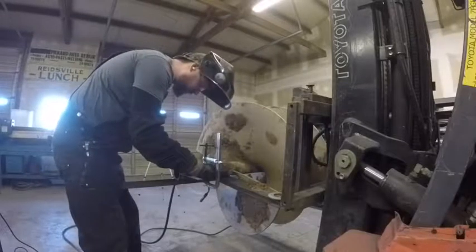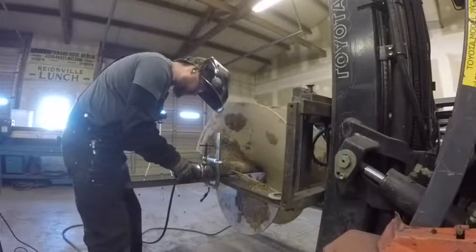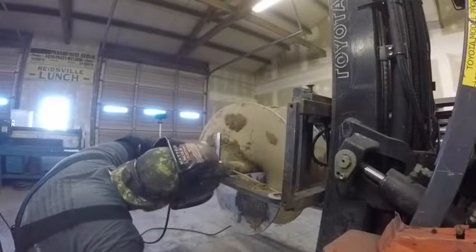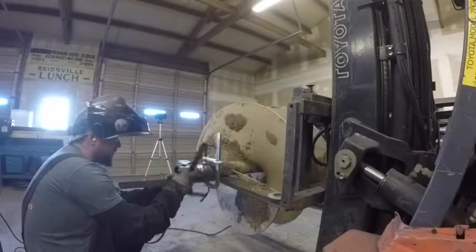and then we've left enough space for the small piece. It's about, I think, 5 inches long, the piece with the pin holes. And that's the piece we're attaching to it. So you're going to butt your bevels up, and they're both going to just lay in that piece of channel. That's not going to make it perfect. You're going to have to fudge it. You're going to have to tap it here and there.